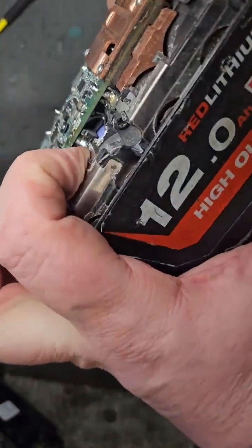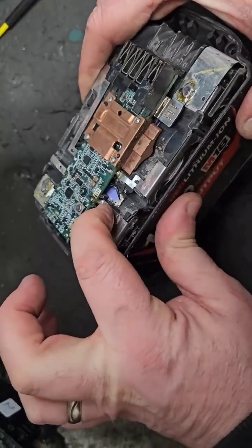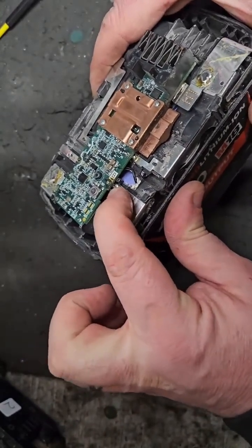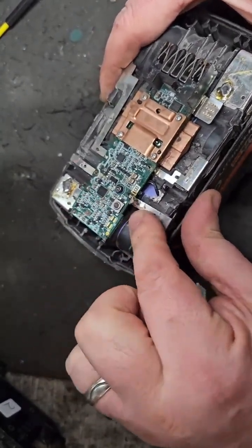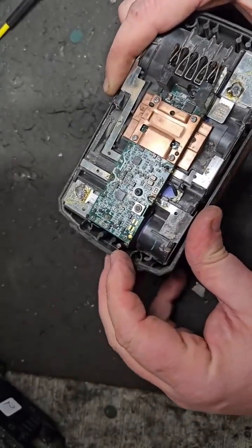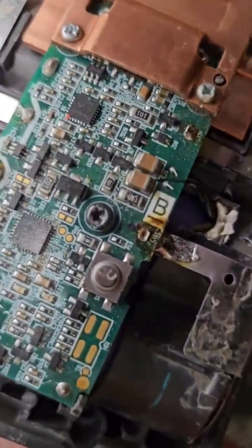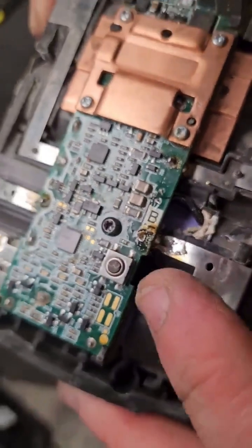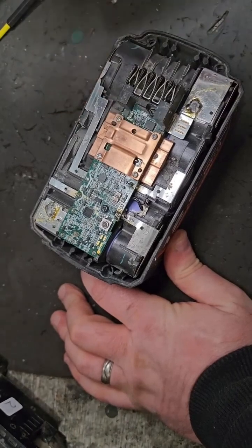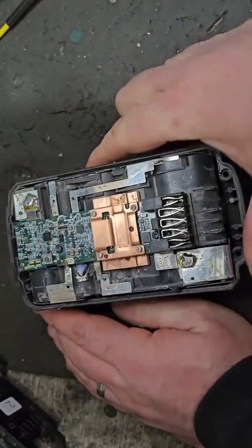The connection's not good — it might just be a bad connection on the top of the board. All the cells are good there, we just need to redo that. As long as he hasn't overheated it — he's done a bit of a bad job there because he might have overheated some component in the board. If you do that, you wreck the board, but these boards can be got. So potentially a board and a bad connection is what we're going to write down for that one.